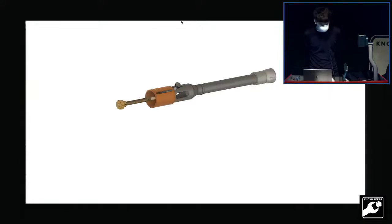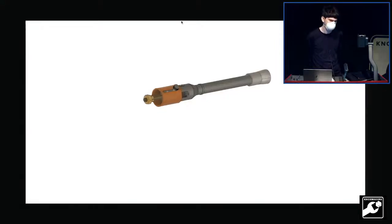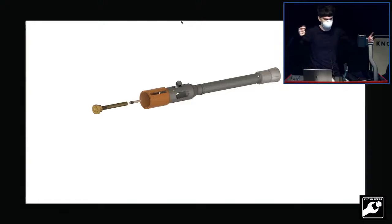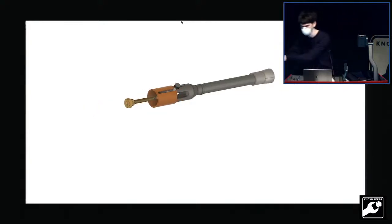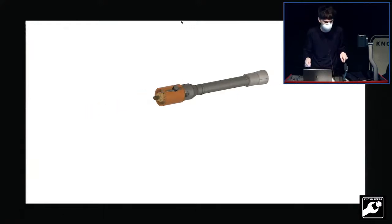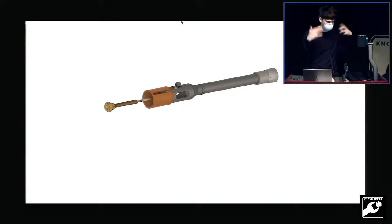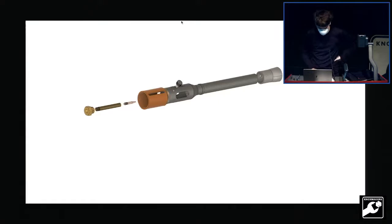The reason I wanted to build a CAD model is that when you're in a machine shop, it's very useful to have good quality paper drawings, printouts with all the dimensions, that you can get oil on. You don't want to be going to a computer and looking up a measurement. If you make all your measurements on a piece of paper and do all the math in your head, it's easy as long as the number of measurements isn't too large. But when you get too many parts, it's very easy to make a math error, which is where CAD comes in.